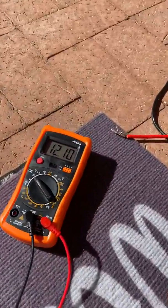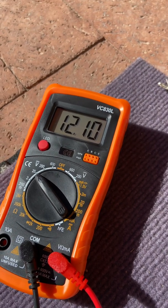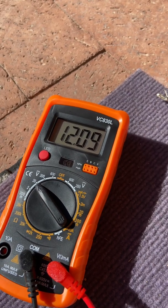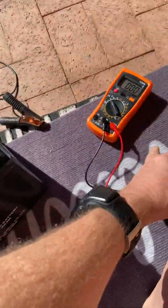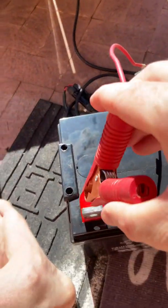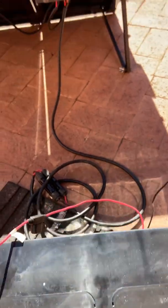Right this moment I've got the battery connected to a voltmeter and you can see there's some voltage in the battery itself. I've been charging it using a wall unit charger, and at the moment it looks like it's got about 12 volts, which should be enough to activate the Renogy solar panel. So let me pull the voltmeter and connect the positive cable from the solar panel charge controller and the negative, and show you what's going on.